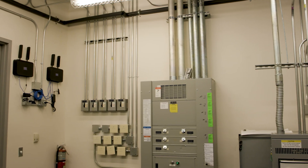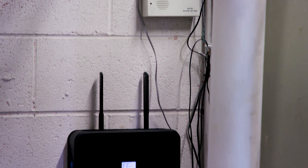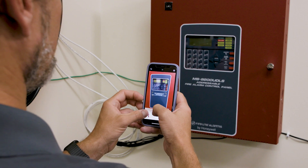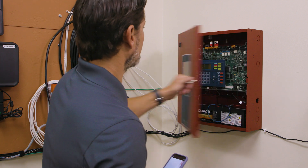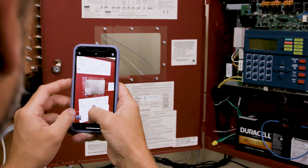On the day of installation, arrive at least 15 minutes prior to the scheduled installation time. Start with a property tour with the on-site contact. Ensure that you will have access to each area where entry is required to complete the installation, including the MPOE or demarc. Locate all equipment to be connected to the AirDial service. For each piece of connected equipment, you will want to first take photos of the equipment. This includes fire panels, burglar alarm panels, gate boxes, and elevators. Make sure the photos show the make and model of the equipment if possible. Also take a photo of any external dialers.